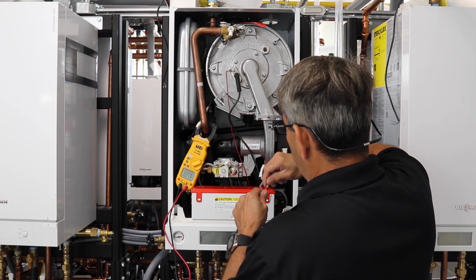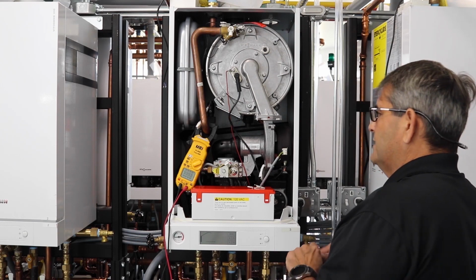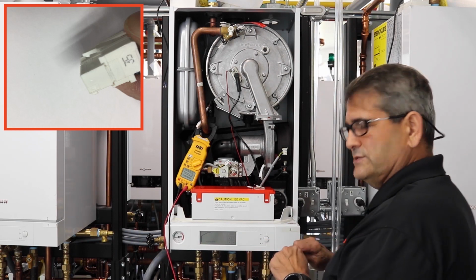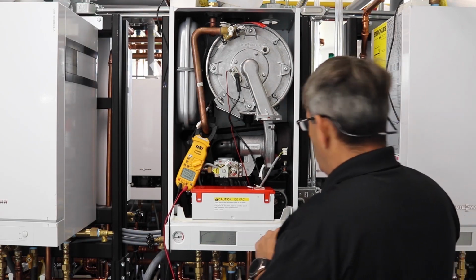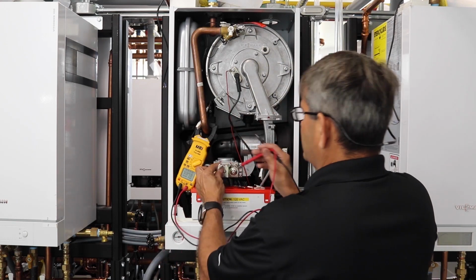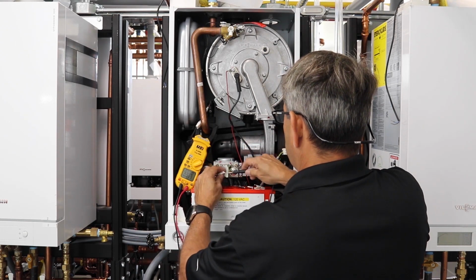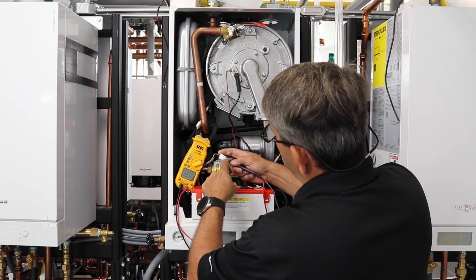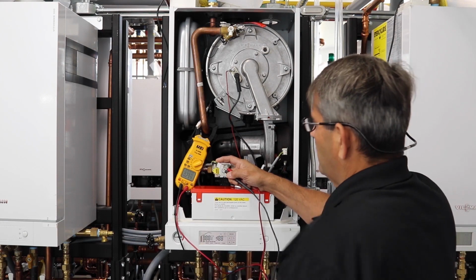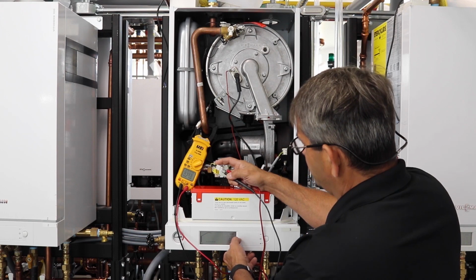Normally what I see here with no resistance, you're going to get about 106, 108 VDC. When it's connected to the burner, you're going to get that 106, 108 because you're going to have some resistance through the coil as well. So we're just going to take our prongs, stick them in our two outer test ports, our plugs on our control. If you have smaller prongs, they work pretty well, but we're going to now power our burner back on. And you'll check our voltage here. It should be roughly around 127 VDC when it goes to fire.